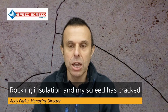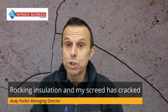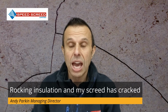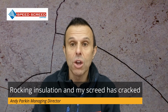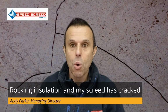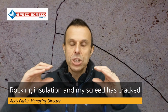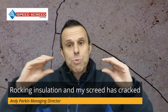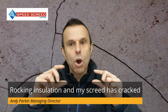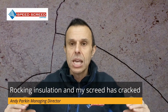There's an old adage in the screeding industry that the screed is only going to be as good as the substrate it's laid onto, be it concrete or insulation. As you've identified, a rocking surface doesn't leave a suitable substrate. A screed has very good compressive strength, but when it becomes long and thin, the flexural strength isn't as strong, so its ability to resist movement depends on the substrate and its strength.